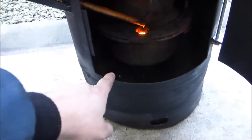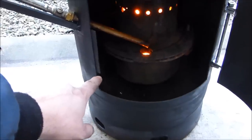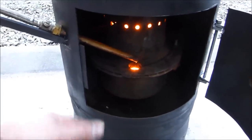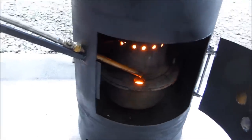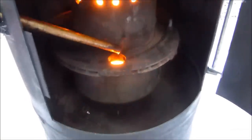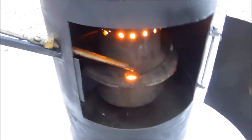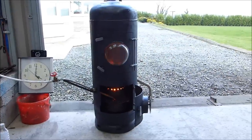You just throw in a bit of white spirits. The side walls of the pot in here are going to get red hot shortly. Once that happens, the oil going in is vaporized and burns better. Just waiting for that reaction to actually happen. We're going a minute now — a minute and 16 seconds. It's already beginning to produce heat. I don't think my paint is going to last very long on this — I'd say it's going to burn off.